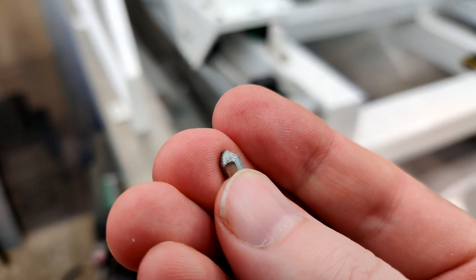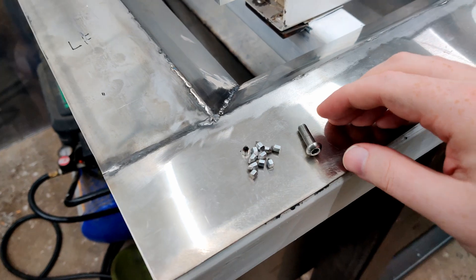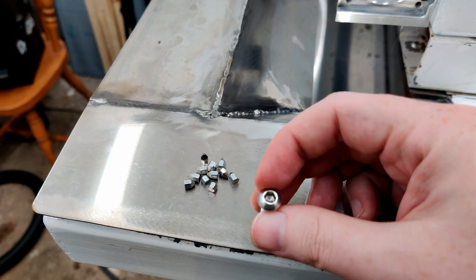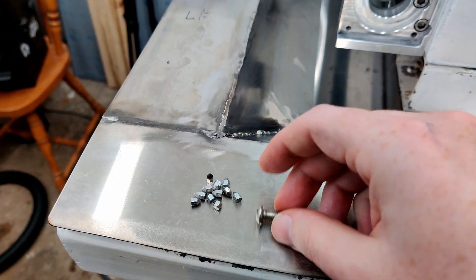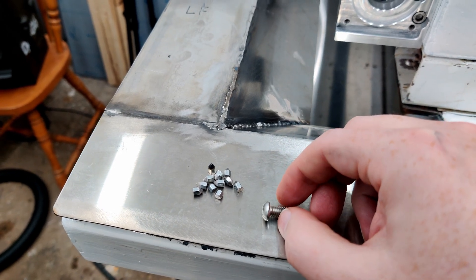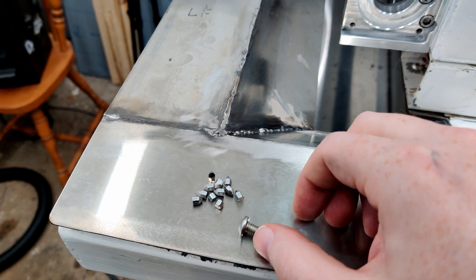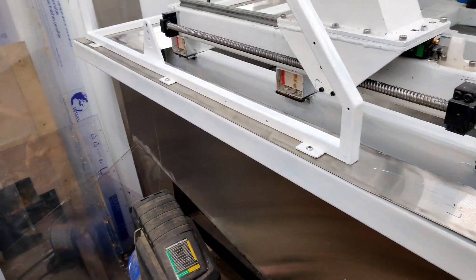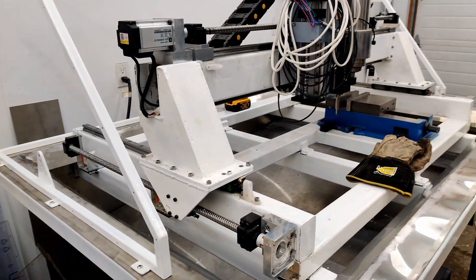It rounded the tips out, so these were definitely one-time use. I had to hit it with a decent amount of force with the hammer. These bullets were threaded in all the way so that the force of the blow from the hammer is directed onto the top, not onto the threads. Otherwise I would have just damaged all the threads in the steel. So that worked out well.